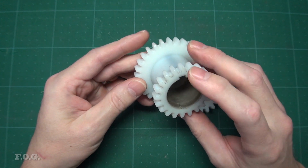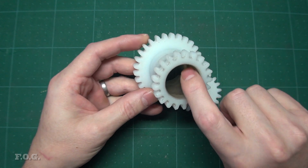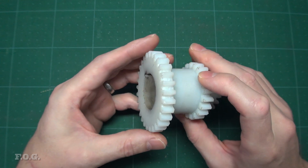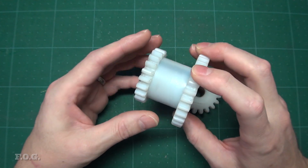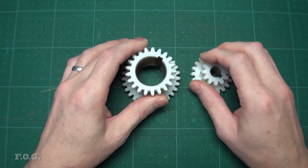I think what was happening is that as the speed of the main shaft increases, the rotational forces push the key outwards, forcing the large gear to be off center. That would explain why the vibration becomes more prevalent at higher speeds. Anyway, let's go back to the metal gear installation discussion.